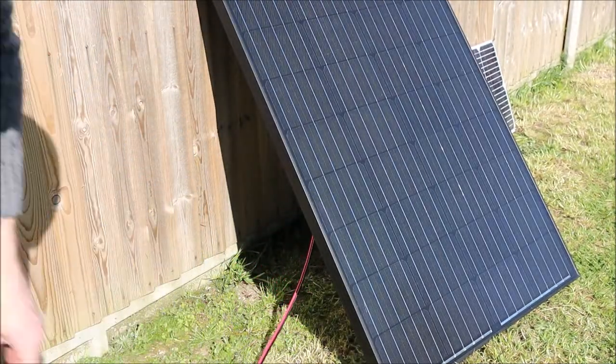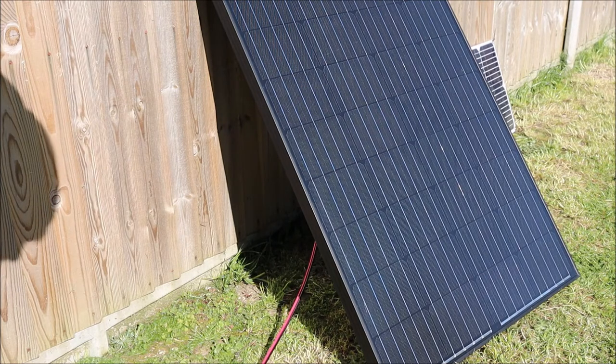Over the last week I've seen around 57 or 58 watts as the norm when the sun's been out, which is great. Because when you switch on the AC inverter you lose about six or seven watts, so I've probably got about a net of 50 watts. So anything I plug in that's less than 50 watts means the battery continues to charge or stays fully charged. If you go over that, it just means the battery takes longer to discharge — effectively you're buying time. If the equipment you're using adds up to about 100 watts, you're only actually drawing 50 watts from the battery because solar is topping it up. For me, that sort of semi off-grid working has been working perfectly.